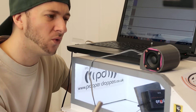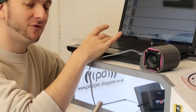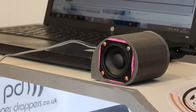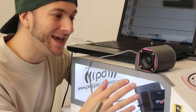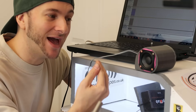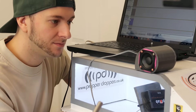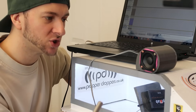Keeping within the 1 or 1.5 mm of X-Max that it says it has, it sounds good. The higher frequency you go, the less excursion you have for its relative output, so 198 Hz sounds a bit better to the ear, though there are still some distortions at the higher limit of excursion. You can also actually hear the air chuffing from behind the driver — the basket on this driver is quite limiting in letting the pressures generated by the rear of the cone out through the gaps and through the motor and coil. At 270 Hz it sounds way cleaner — there's not very much distortion I can really make out at that level.